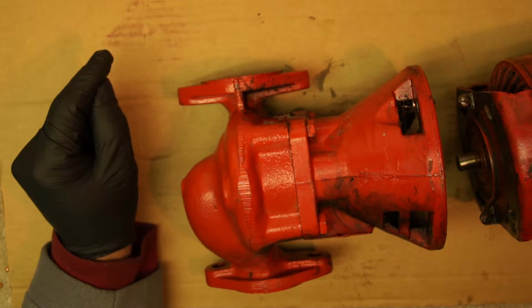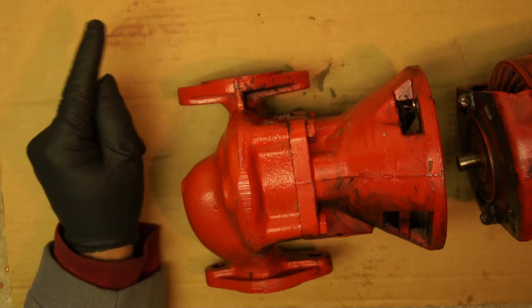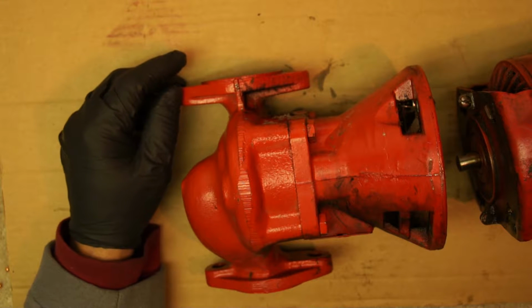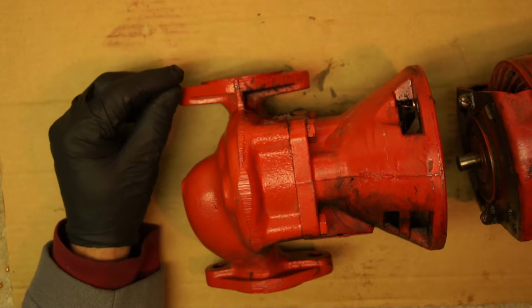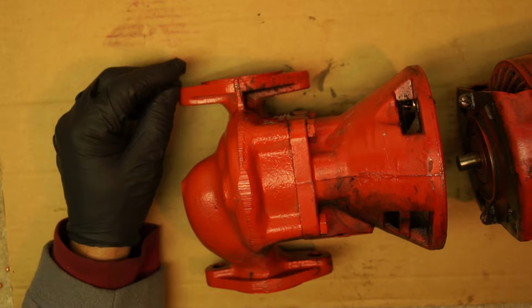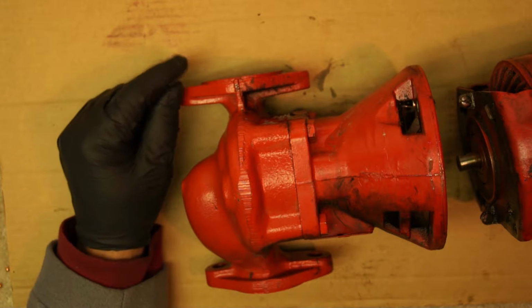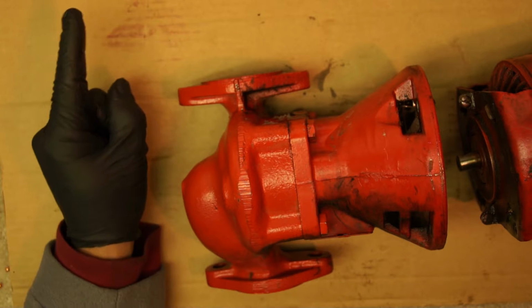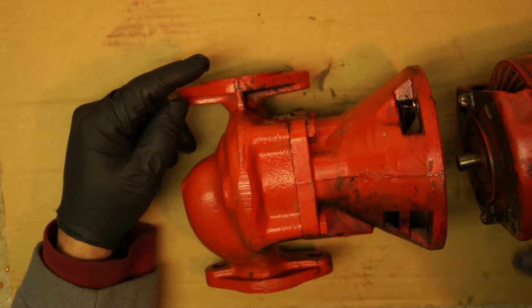when you raise your thermostat in your living room, bedroom, wherever you got your thermostat, okay, I want the temperature to be at 80. What happened? That thermostat is going to close, because what that thermostat is, is a switch. It's an open and close. That's what it is. It's a switch. So that thermostat is going to close. Then it's going to close the circuit in that relay. It's going to tell that relay to send 120 volts to this pump over here. And what's going to happen? This pump is going to start working.